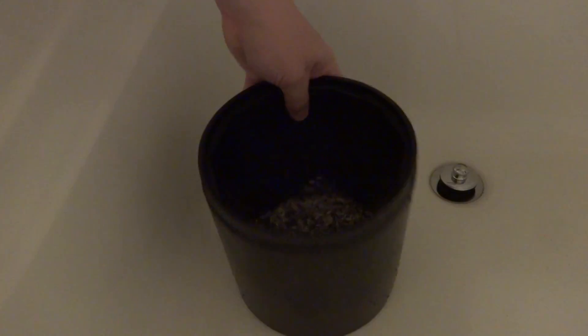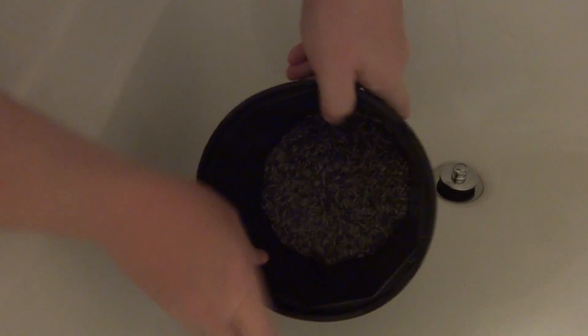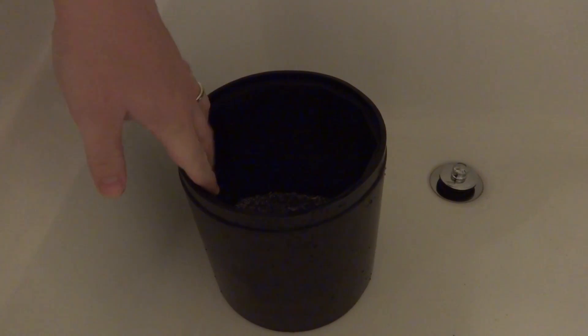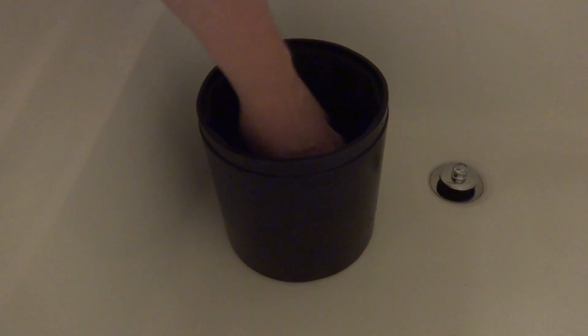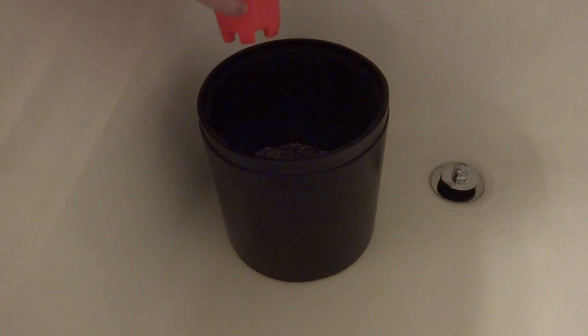So what I'm going to do now is take the other five pounds of stainless steel tumbling media, add it so we'll have 10 pounds in there, and this time use less water and less soap — that was way overkill. I also noticed the little steel pins tend to get stuck in everywhere, but you can go ahead and pull them out with your fingernails or a little pick.